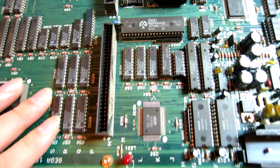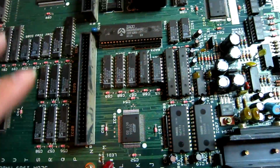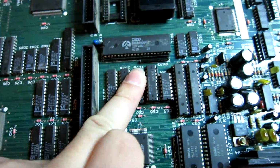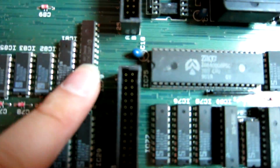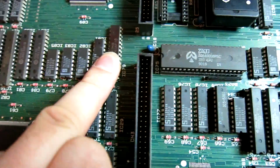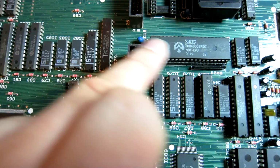As I've been struggling to find a fault in this area, I've taken the ROM board off. I actually realised that some stuff here is connected to the same data bus as the Z80. I didn't realise that, but there's actually a RAM there. So I think this here is actually the PCM RAM, and this is the Z80 CPU RAM, so I'm just going to whip that one out and test that one.